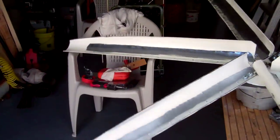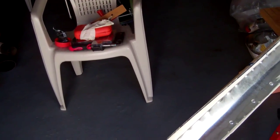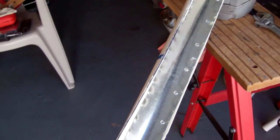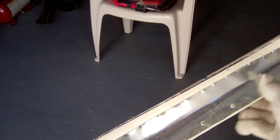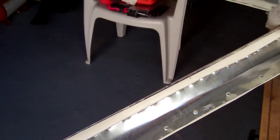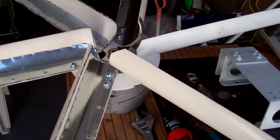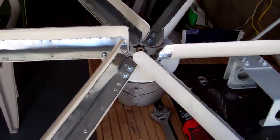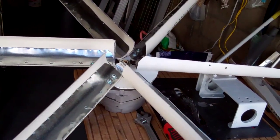These are PVC blades, which I generally don't like, but I've been reinforcing them with a galvanized metal strip. These are riveted, and I purposely made them a little wider in case I need to cut them down or shorten them. I was so excited that when I had two of them turning, I immediately installed the rest.